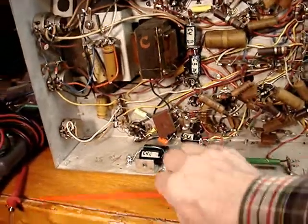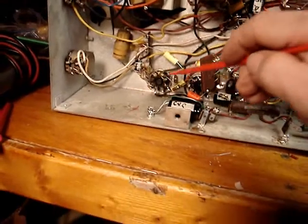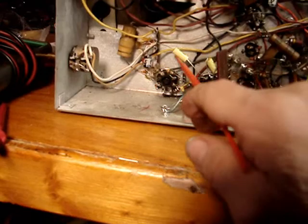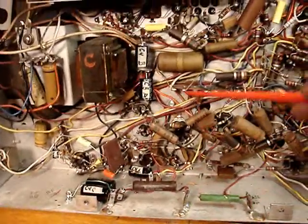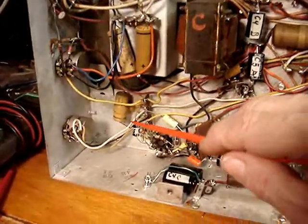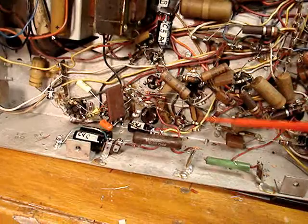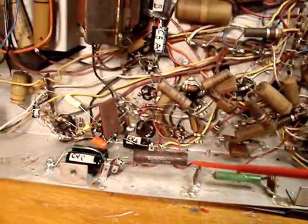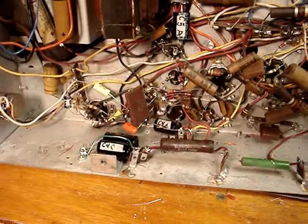So here's what I've done so far. I've replaced all of the wax capacitors involved in the vertical circuits here — these three are all new, and this one here. I've also replaced the electrolytic cans on the chassis with these capacitors. I've labeled them accordingly: here's C4A, C4B, and C4C right here. This is a 60 mic — two 33's in parallel.